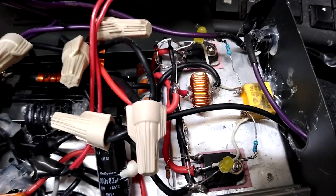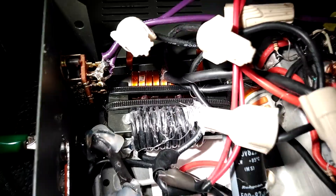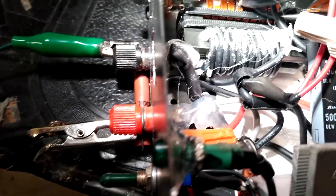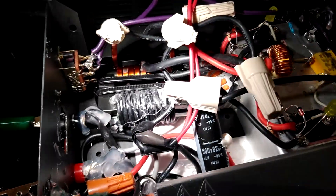This is the ZVS driver. I've got two pretty beefy MOSFETs pulled from a TV board, a heavy-duty full bridge rectifier, and a capacitor. The output transformer has very few turns — about ten on the primary and about ten or eleven on the secondary. Since this is high frequency, it needs to be a high-frequency transformer, like from a flyback driver, using a good high-frequency ferrite core.